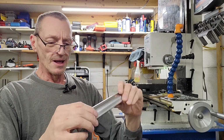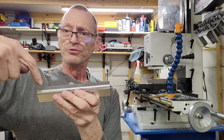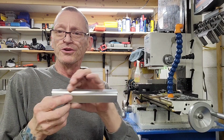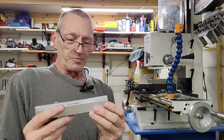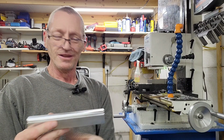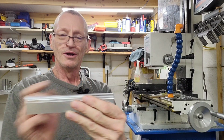That's all this was about, was cutting up the profile of a rail. Basically, we put the recoil slot in all the way down, but that's so easy. There's nothing you're going to learn from it. It's just running an end mill at a specific depth and cutting straight lines all the way down it, specific lengths apart from center to center. So let me turn this off, and I'm going to set up on the bench over here.